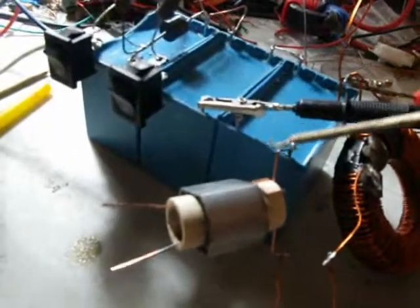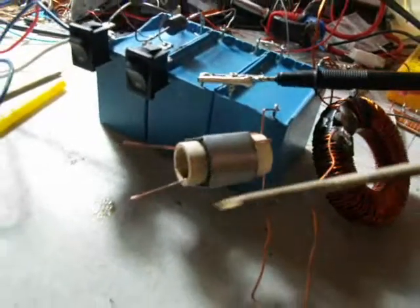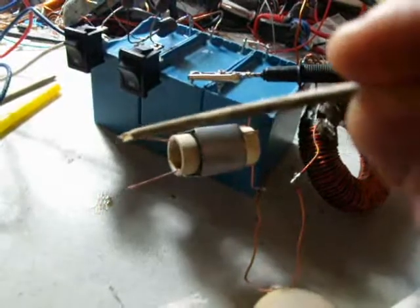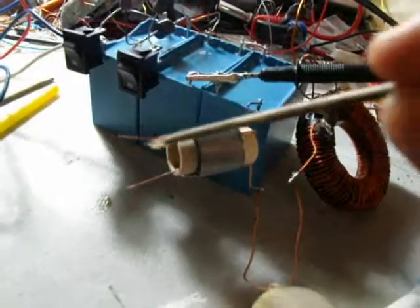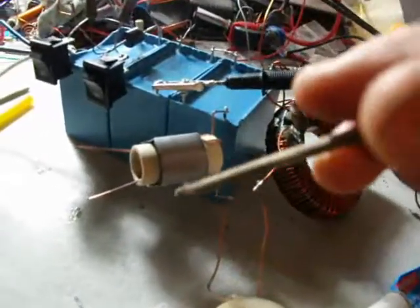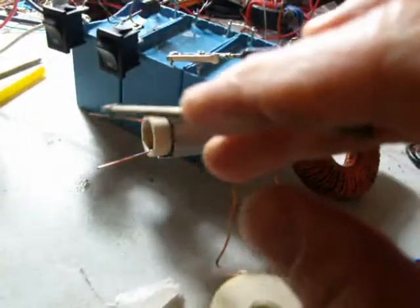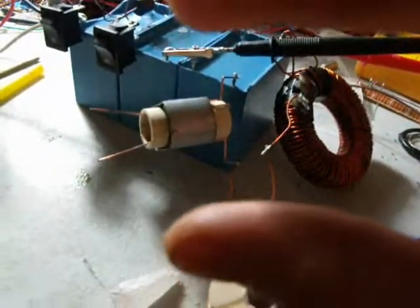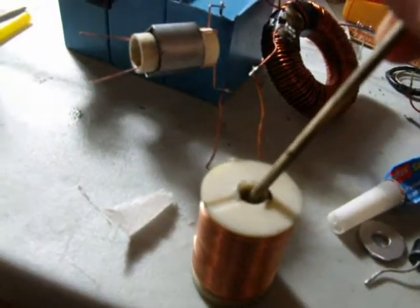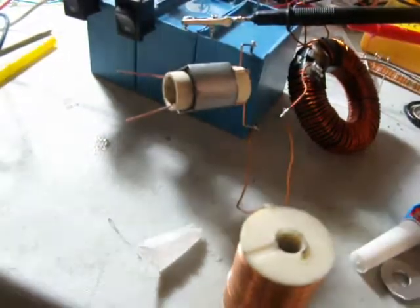I took two capacitors. All together it's gonna be 32 joules of energy. Two rails, like in a railgun, coming inside here, inside the barrel. And as you can see they're separating in two different directions, making a plasma discharge arc, pushing to increase its length. Here's the inductor to limit the current and prolong the charge a little bit, so you can see on camera the plasma discharge actually.